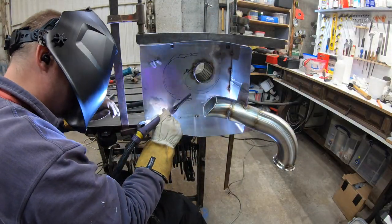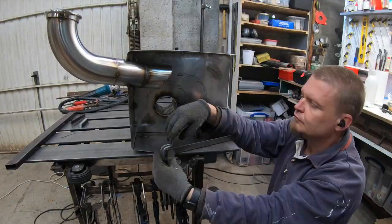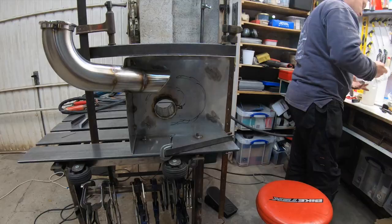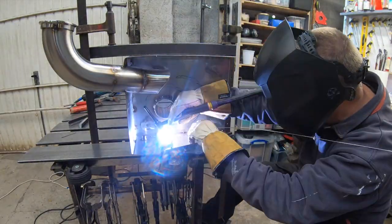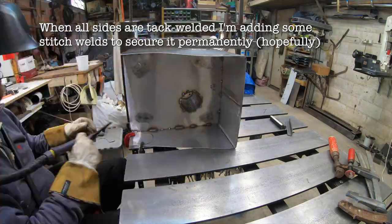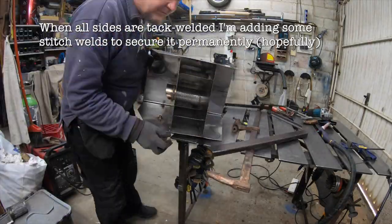The process turned out to be carefully clamping and adding as many clamps as possible. Then carefully tack weld the first tacks and then add more until there was a tack about every 20 to 30 millimeters. Unclamp it all and then try to find another way to clamp it with a reasonably comfortable welding position. Keep repeating this until it was all tacked. Then do it all again, but this time stitch weld it so that it would be as solid as possible, without too many Picasso influences.